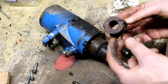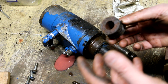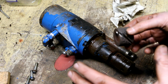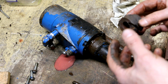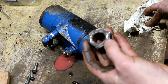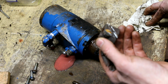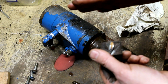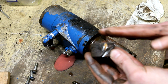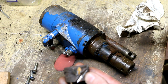But this particular steering wheel on this particular model, which is the Rowcrop 5000, aka the 5200 made in England tractor, has what some describe as a deep dish steering wheel. So if you just look online for a generic Ford 5000 tractor steering wheel, you're not going to find the deep dish one. You're going to find a steering wheel that is much shallower. What I mean by deep dish is the distance from, say, this surface to the surface that is formed if you put a board across the top of your steering wheel.